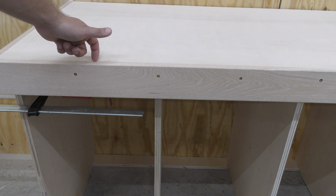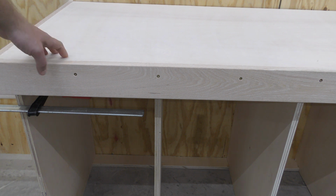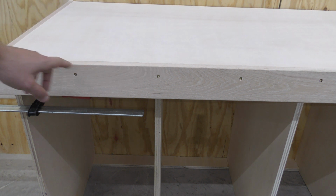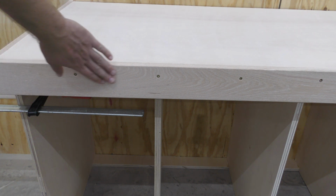Once the board is attached, right, there's always going to be a little lip, just because the board is going to be slightly warped compared to the surface. So I sanded it all down, starting with 80 and working my way all the way up to 400, so it's nice and buttery soft now.